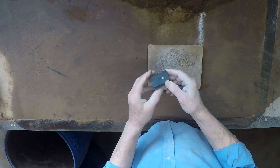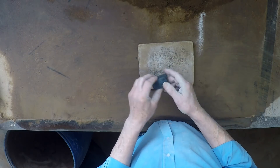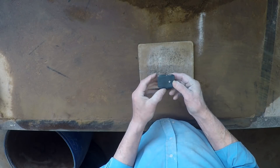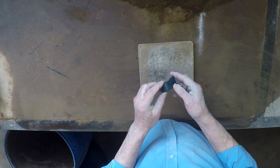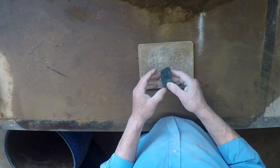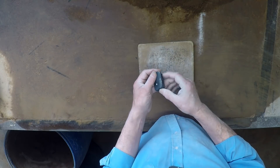This is a little blanking prism that fits in a runway light. Sometimes they don't want the light to shine in certain directions, so they pull out the glass prism that's there and put a solid metal one in instead. It has to be the same shape and size as the original glass one, as it seals against rubber gaskets to keep the weather out.